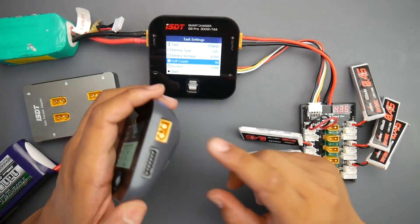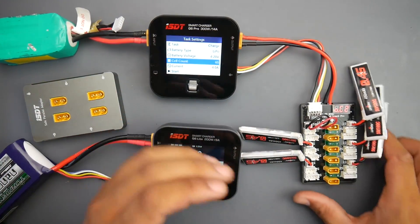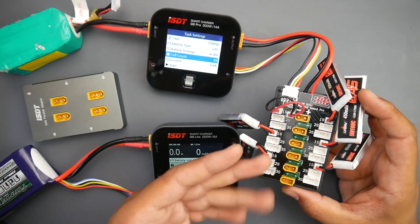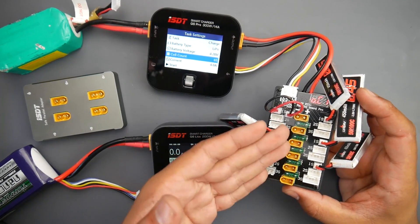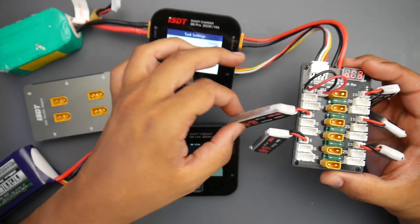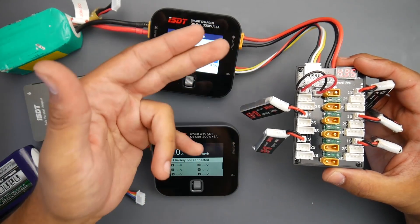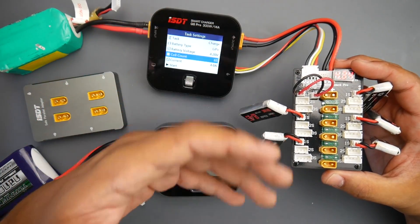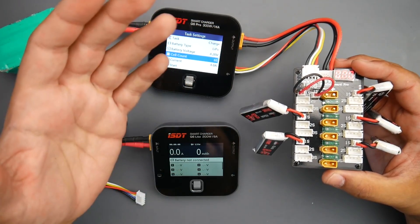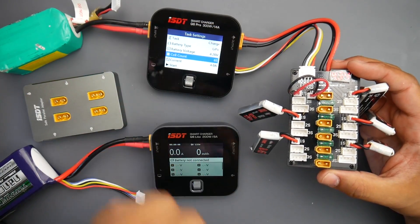Some of you might think it's useless because it only has one port, but the whole idea with these is to do parallel charging on the go. For example, I would set one of my 4S batteries and bring a parallel charging board, whether for my big lipos or my baby lipos. This parallel charging board is great for micro setups from XT30s to 1S HVs. It allows you to not only charge, but also discharge and set to storage — storage charge puts the battery at a safe level, anywhere between 3.4 to 3.8 volts, to preserve performance without degradation.